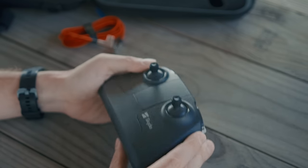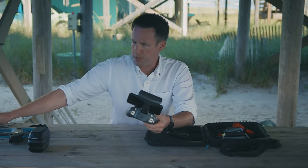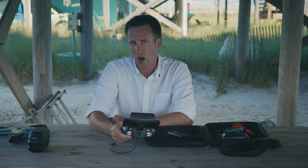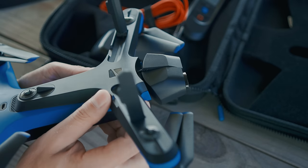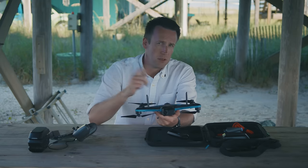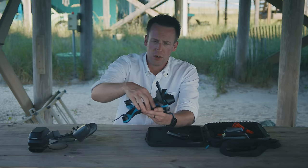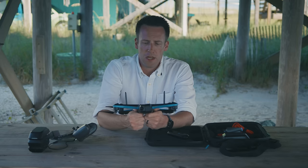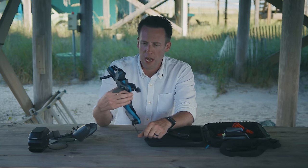That means repurposing a controller from Parrot — it works just like pretty much any other drone controller. You stick your phone in here and hook it up with USB cables. This is a directional Wi-Fi antenna that has reasonably good range. The radio system inside just uses standard Wi-Fi — it doesn't use a fancy proprietary transmission protocol like DJI does with Lightbridge. One of the advantages to going with regular stock standard Wi-Fi is that it's less obvious that you are flying a drone. There are not going to be quite as many electronic warfare devices specifically looking for standard Wi-Fi signals as anti-drone tools that look for that Lightbridge signature.